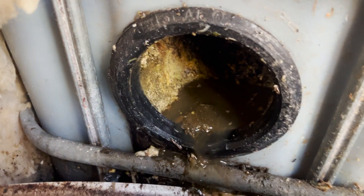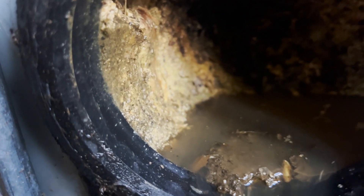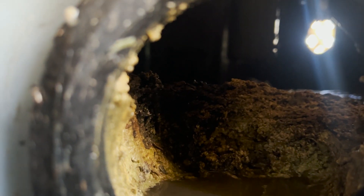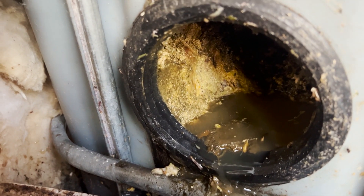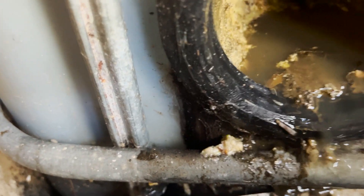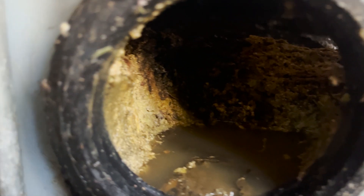This is the front porthole that I made for the food inlet, which is pretty chockers — all just food waste, grease and all sorts of muck. There's the outlet hole. There's still quite a bit of sludge in there — all the solid waste. With the Home Biogas system there's no drainage hole, so if you want to empty it or move it... that's a lot of sludge, going down at least another six inches, and that's above the hole. I don't know how that's going to fare after a couple of years of use.